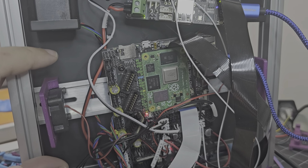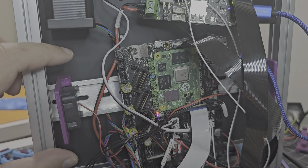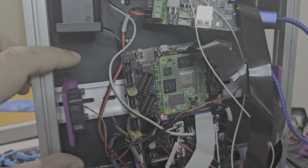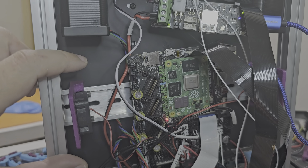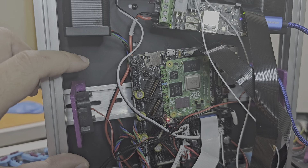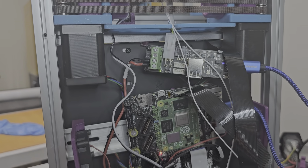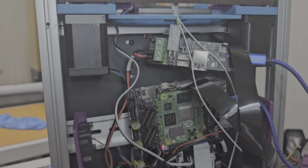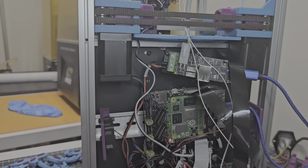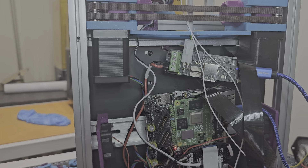The other reason for the Manta E3EZ is it supports the TMC 5160 stepper drivers, which I already had some of spare, and it also supports operating those stepper drivers at 48 volts. The IRM-90-48ST from Meanwell is a small 48-volt power supply. It is 90 watts, which is enough to drive at least the A and B steppers.